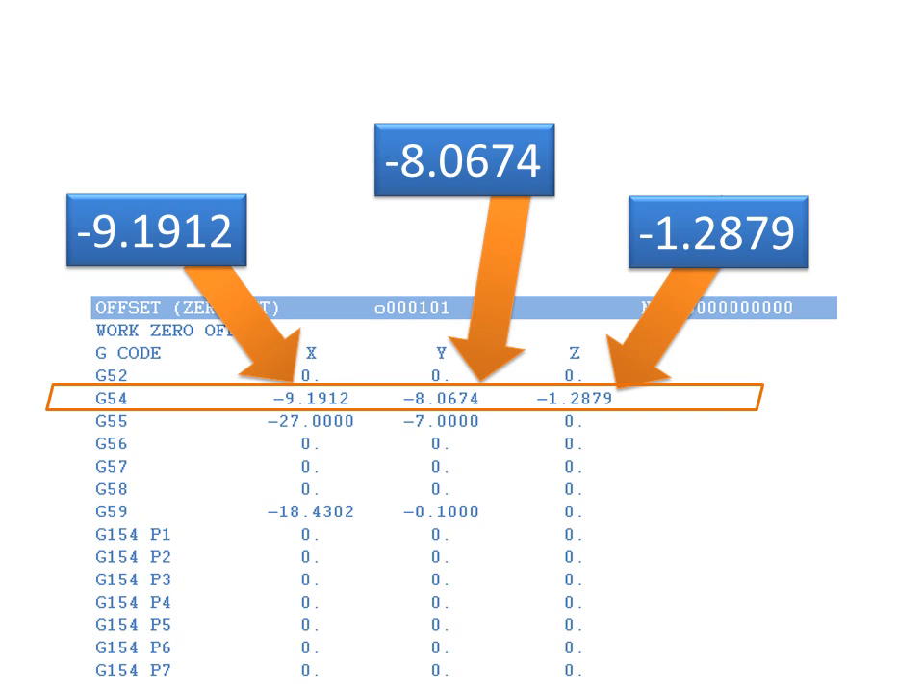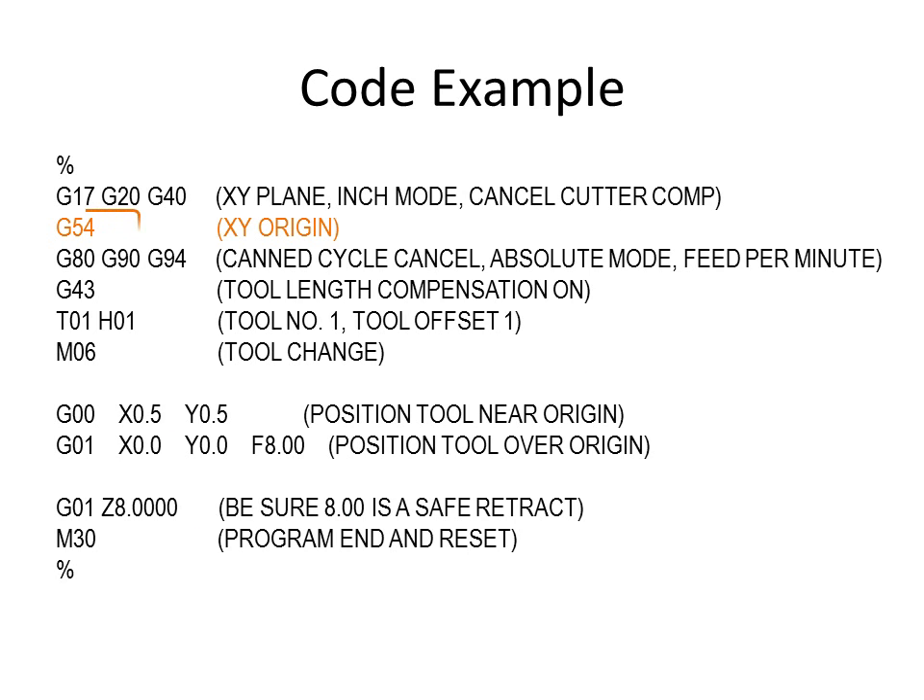You might want to use this if you have a vise that's permanently attached to your table — you can use the fixed jaw of the vise as the offset origin. But here we've got several different places we could do this. So we could have G54, we could do the same thing with G55 and store it in a different location. Maybe we have two vises on the bed of the machine. And we've got G56, 57, 58, 59, and then other machines will add some more, but these are the fairly common ones: G54 through G59. The way we would call this in code is just to call G54 before we start using any geometry, and then the machine will know to offset its origin by those values in that offset register and use the coordinate system that we picked on the table of the machine.